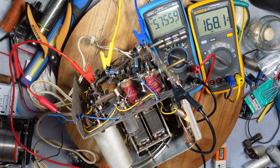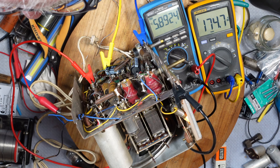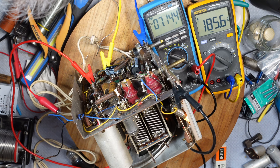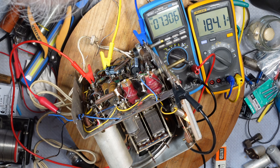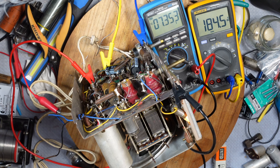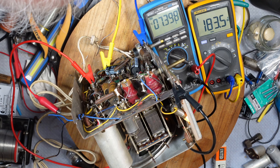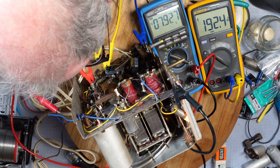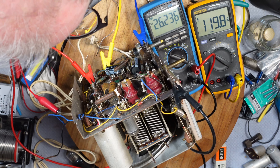I can't hear anything yet. I can't smell anything or see any smoke. Bringing this up to about 207 volts — and 185 on the supply. I'm really going to have to search out the schematic for this. I cannot find it except on Radio Museum and it doesn't have the same valve lineup. There are no model numbers stamped on the chassis or anything like that on these. Right — we're not smoking, but I can smell something. There goes the smoke again.